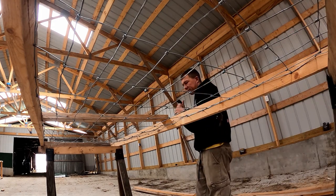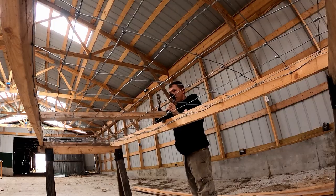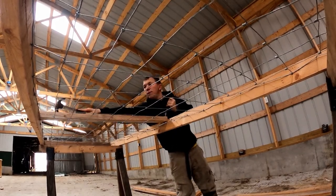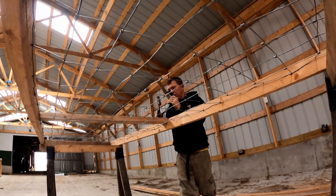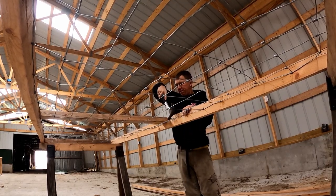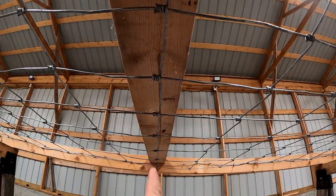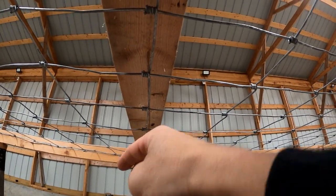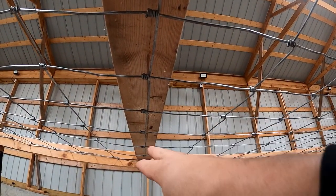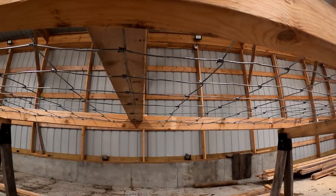On the middle ones they're a little harder sometimes, especially if the board is bowed or if it's a really long pen. Basically all I do is take a flat pry bar to get it in there. Once I get it in, pry bar up. See how I've got this vertical wire running with the board? I do that on purpose because there's going to be another board put behind here and I'll sandwich them together. This also makes it so the fencing is supported in another spot - instead of being supported every 10 feet, it's supported every 4 feet on this one.